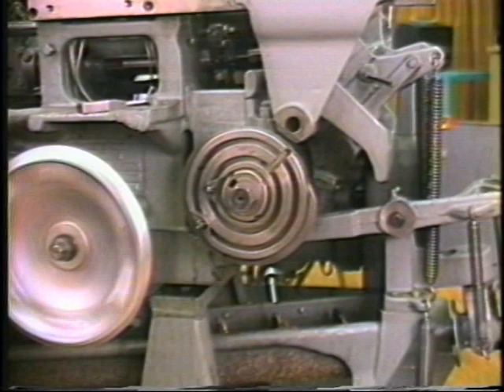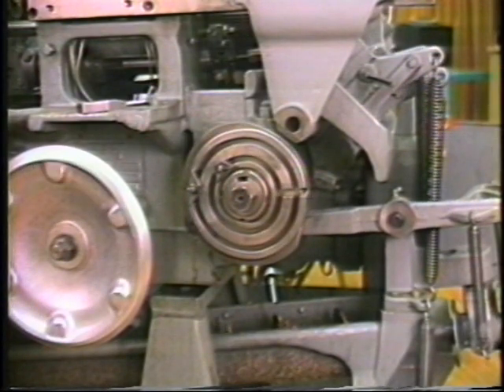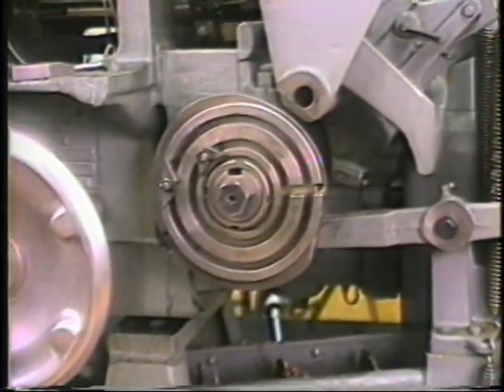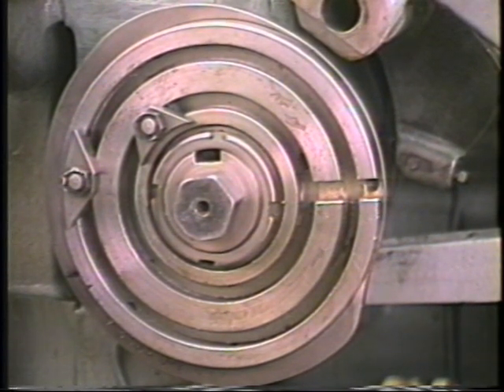The 2763-10SA combination stock stop, face tool holder, and drill holder may be tooled up before the stock length is set. Advance the machine to half index, or 3 o'clock on the slot on the burring spindle opening and closing cam.